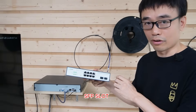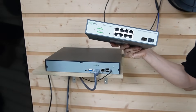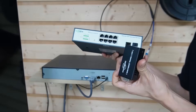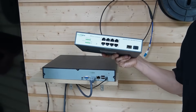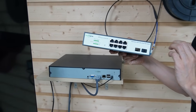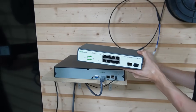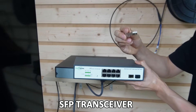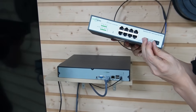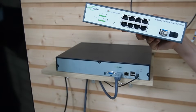These two are the SFP slots, designed to work with the fiber optic cable. The SFP slot works similarly to a media converter — this is a media converter. We can consider this SFP slot as a built-in media converter. We have two media converters built into this PoE switch. However, the SFP slot needs an additional device called an SFP transceiver to work with the fiber optic cable. Let me put this SFP transceiver into the SFP slot. Now it's ready to connect the fiber optic cable.